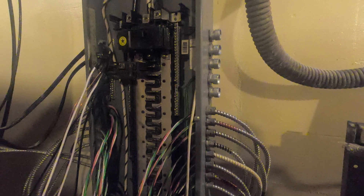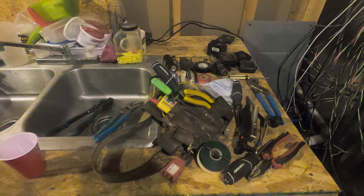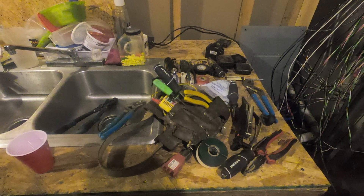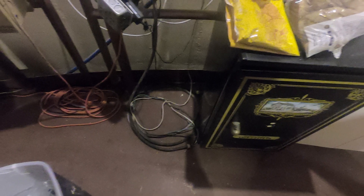At the top that's where we had SO cable — that is really handy. I love it because it's super heavy duty, very very tough. At one point I had six circuits of SO cable, number 10 wire with its own GFI, so in case there was ever a problem it could just trip the breaker. What we're doing now is going back through and taking some of those SO cables out — we're changing a little bit of it. You can see some of that SO cable right there and of course the quad box that's attached to it.